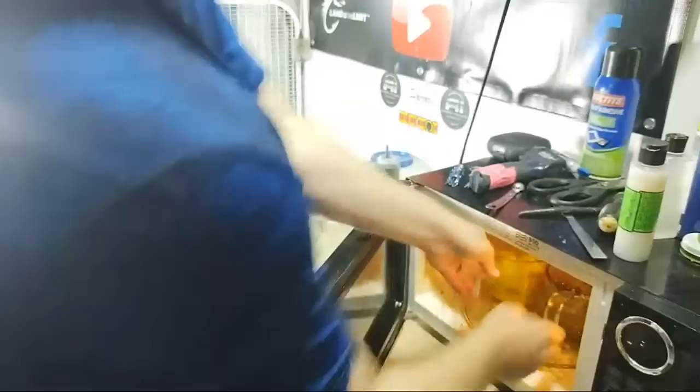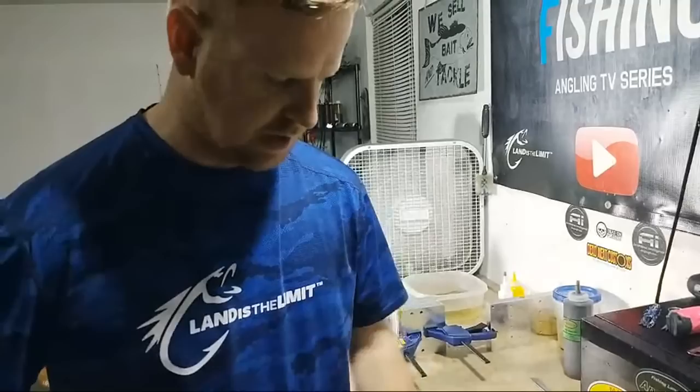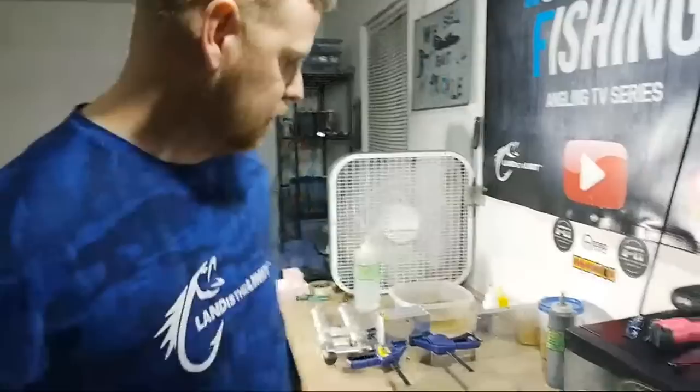You use a split injector with all those AI molds. Can you? Yeah. Pretty much all molds are the same. Any brand of mold is going to have a 5/8 inch port on the top. And any injector you buy, at least from an American manufacturer, is going to fit any mold that you buy. So they're all pretty good about that.